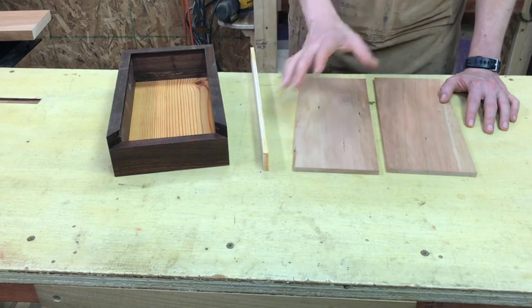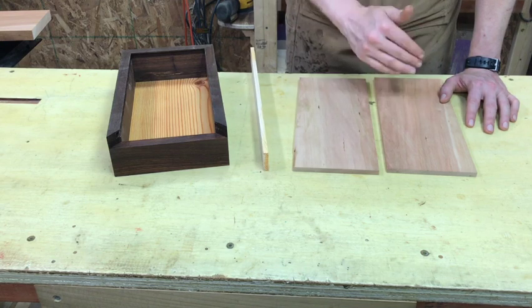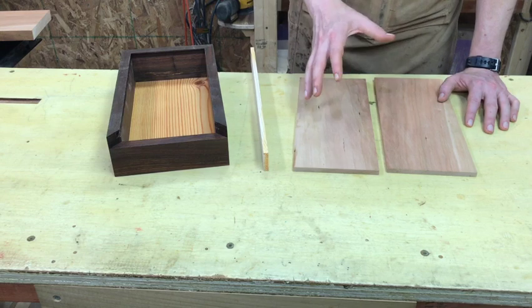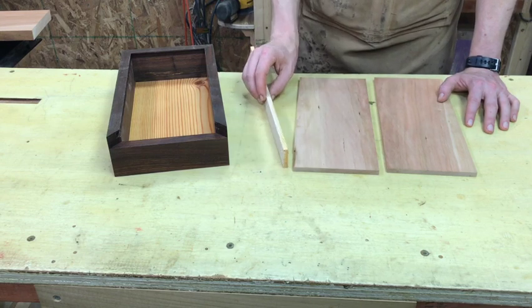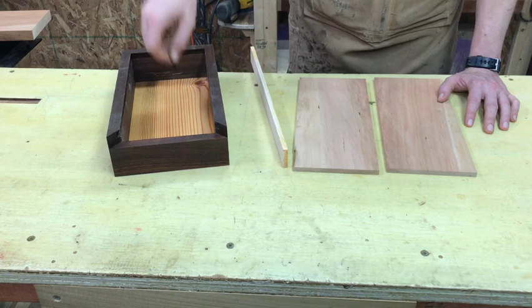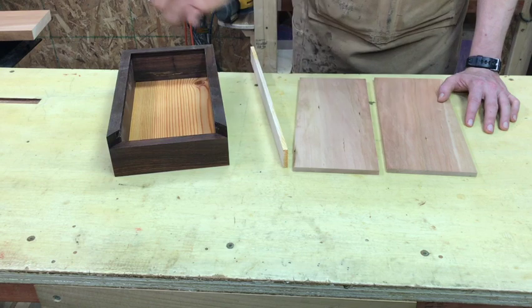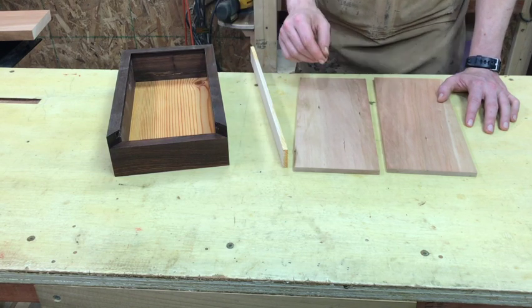And we want to cut a little over, and then when we go to cut the miters, we're going to trim it down a little bit by bit. If you like to live dangerously, you can try to get the dimensions perfectly right from the beginning, but this test piece is very helpful in determining how hard they are to pull out. If you only have one tray and it's not getting pulled out, then it doesn't matter, make it as tight as you want. Or in fact, I would just put dividers alone in there.